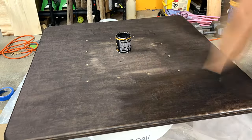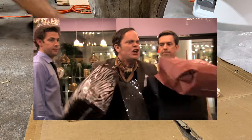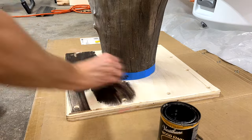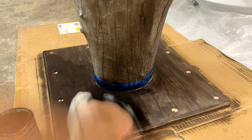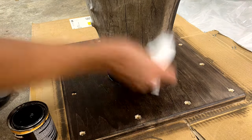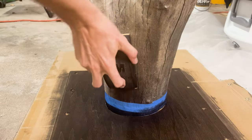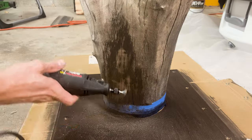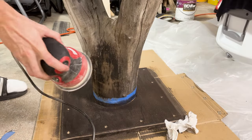As I apply a few coats, we'll arrive at by far the largest mistake I made on this project. So right here, you'll see I taped off the bottom of the tower because I want to use a different finish on it than the base. But going one piece tall ended up being a very poor decision. You can see I went above the tape line and got stain on the trunk, which started a long, painful process of trying to remove it. I'm sure at the time I thought painters tape costs some amount of money and I don't like to waste money. Sanding would remove it, but would also kind of spread it to the parts that I wasn't sanding.